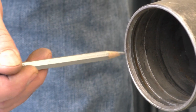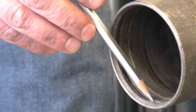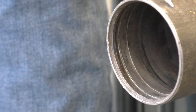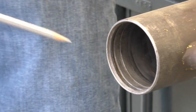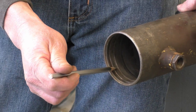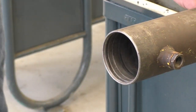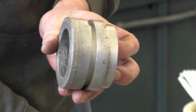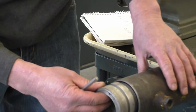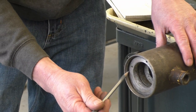We're going to machine a head that is thicker and goes over here and recreates the snap ring groove right in here. We'll take measurements from inside of that snap ring groove — the ID of the snap ring groove, the OD of the tube, and the ID of the tube. On this tube there's a counterbore right in here and it measures 3 inches 25 thousandths. On the head there is a step so it cannot go back in further inside the tube. When we stick this in and push it, it stops right at the edge of that snap ring groove.